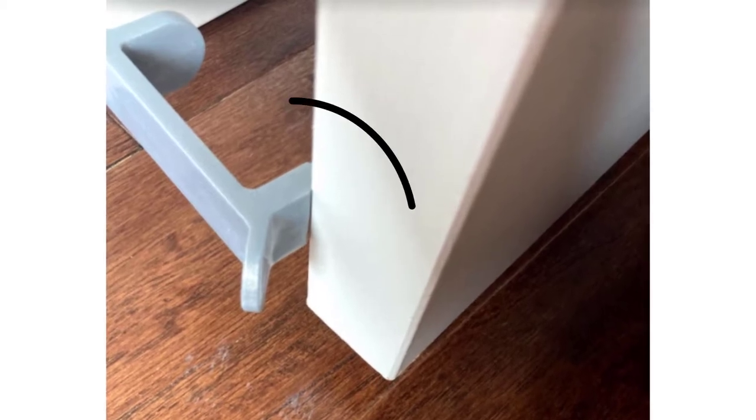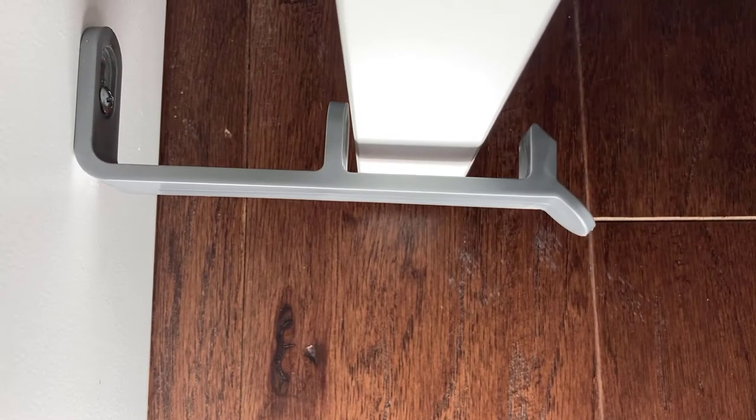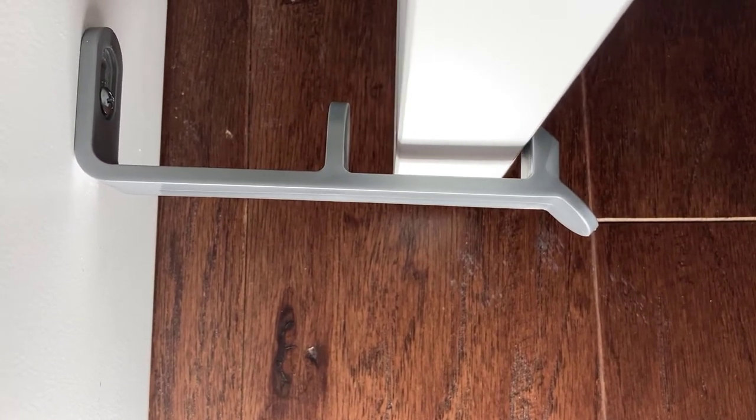You can also adjust the stop to allow the door to be pushed into auto prop mode. Align the edge of the door with the angled portion of the door stop. This allows the door to be propped open simply by pushing the door into place.